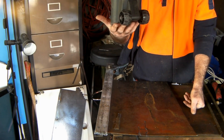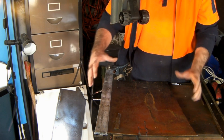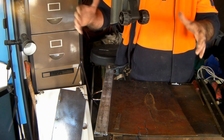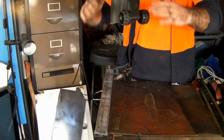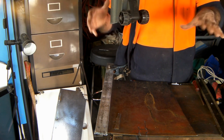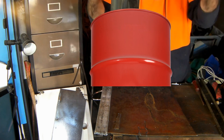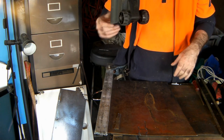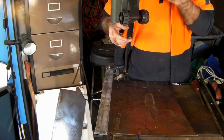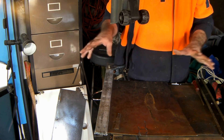So guys, this is about what we're left with — we've got our sucker right in the middle of where we're working. I only work on a quite small table, but I thought if I had a bigger table, I might get a 40-gallon drum, cut it about there, and have a big scoop just above it — cut just the bottom off and mount it up to give a great round suction cup. But in the meantime I'm only using this because I'm just doing short cuts at the moment. When cutting galvanized, the fumes are absolutely lethal — I still wear a mask but I use this as well. It's a little bit noisy, so just put your earmuffs on. It really, really works.